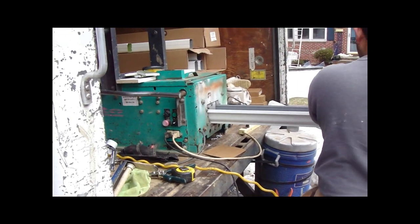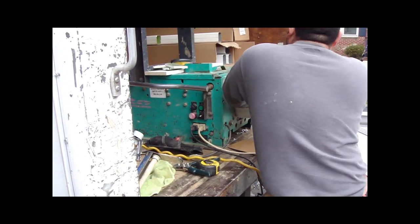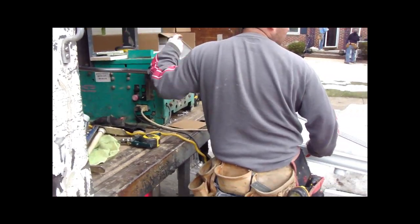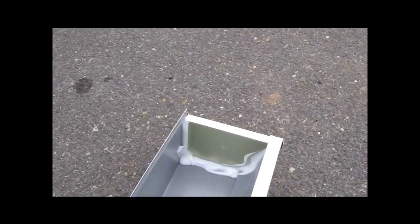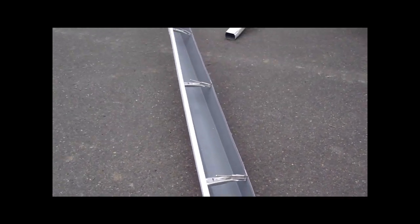So next you're going to see they're going to cut it off, then they're going to put an end cap on it with some quad polymer sealant that can stand up to the test of time. Now this is why we choose to use a seamless system. It's one piece, no chance of leaking, it's easier to level, and there you see an up-close shot of that quad polymer. From the outside, it gets a clean look where we pinch it together.